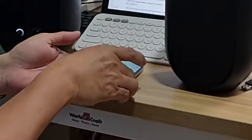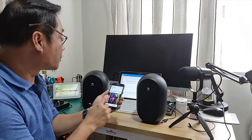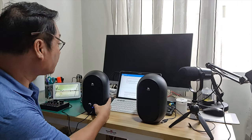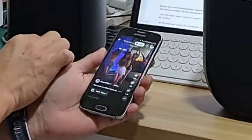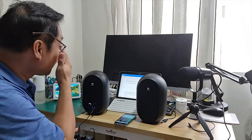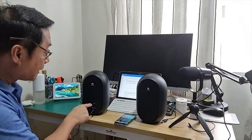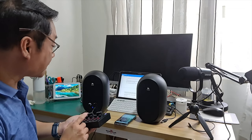As I've said in the beginning of this video, the JBL 104 desktop reference monitors are easy to use. I'm showing you how my various devices are connected to the monitors. So my other cell phone is connected by Bluetooth. So I'm going to select the Bluetooth on the selector button here. And I'll play music from my phone. Next, I'm going to select the auxiliary input. And this V8 sound card is connected via the auxiliary input. I'm going to play some stingers.